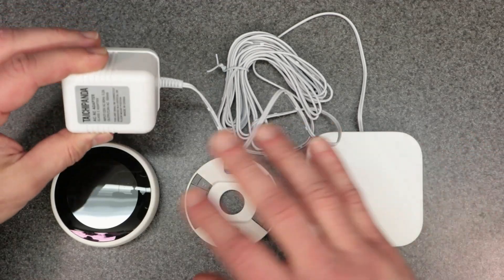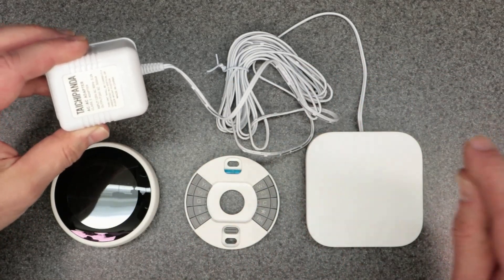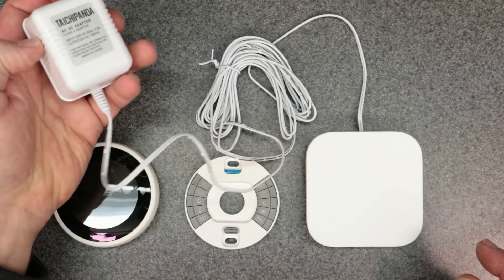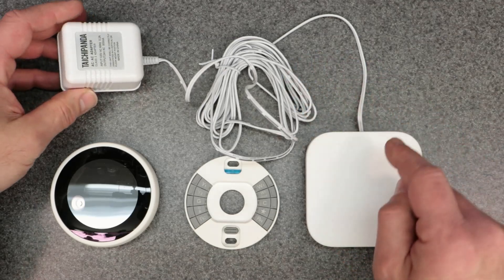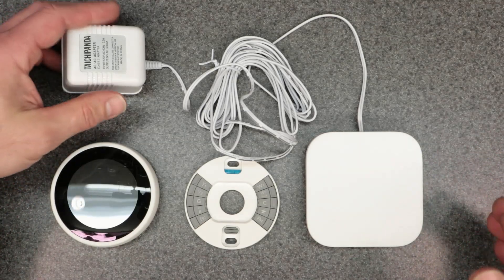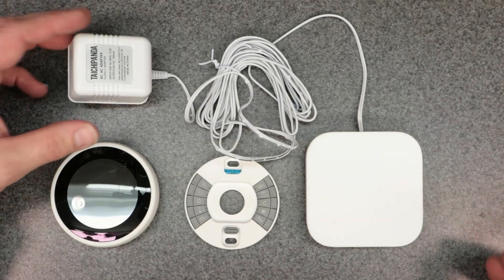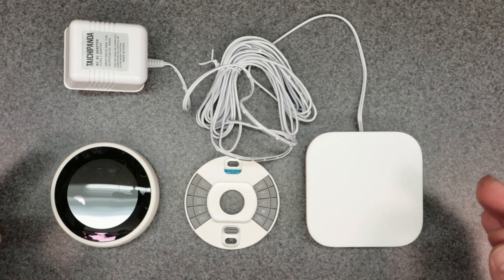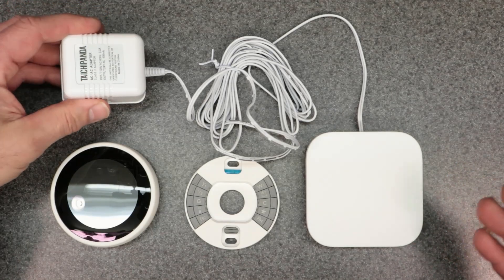To wire up this C wire adapter, it's very simple. This is an external piece — it's going to go along your wall and you'll have to staple it or attach it to your wall somehow, down your trim and to a wall outlet. This is a 24-volt 0.5-amp wall wart AC adapter and it's got two wires that go to the thermostat base plate to power it up. That's basically what I use here on the benchtop for my review tutorials and how-to thermostat videos — I wire it up to the base plate of the thermostat I'm reviewing.